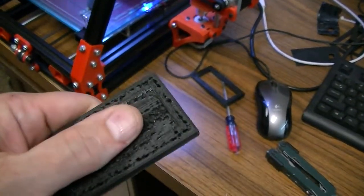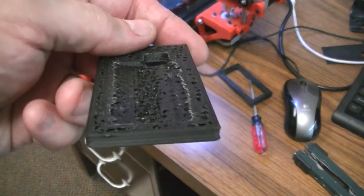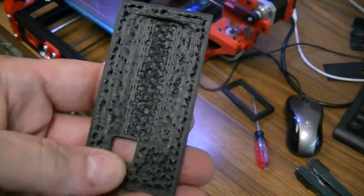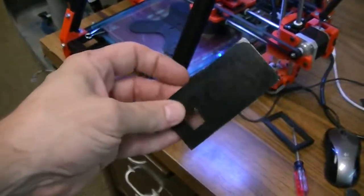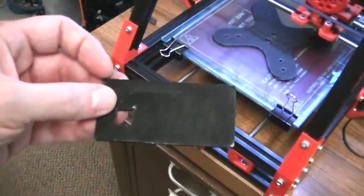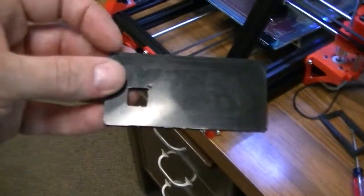This is actually a curved, concave surface there. It counted it as a hole and flagged an error, and when it reached the top of this curved surface it started trying to fill in across, and it got messy real fast, and then the head dragged into it and separated it from the bed. This was just a bad model to be working off of. When Slicer flagged an error when it loaded, it said check your G-code. Well, I didn't know how to check the G-code.